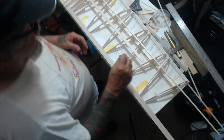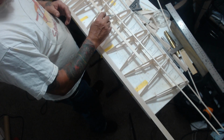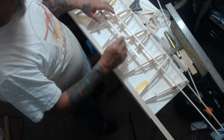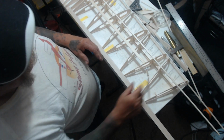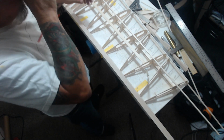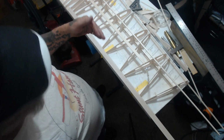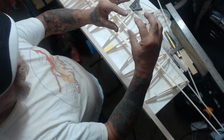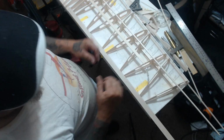As a matter of fact, I've built many airplanes where I've just come out to here with 3/16 shear webbing, and everything out here, there's nothing. There's no 16th, there's no nothing. So if you got light wood, you can go ahead and add that 16th. On the inboard side, of course, the lead outs have to pass through, so you can't have that shear webbing out past probably L7 or 8, somewhere in there, because the rib is hollowed out oval so that the lead outs can pass back and forth.